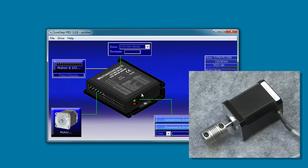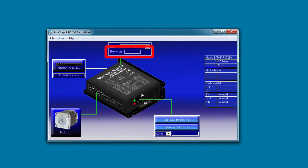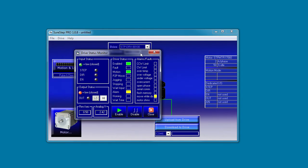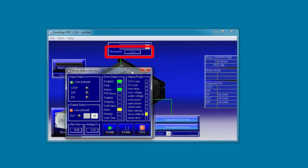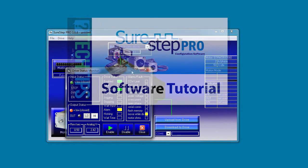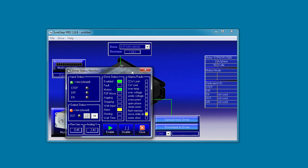To get the firmware rev of the drive, just issue any command that reads from the drive. You could do an upload from the drive, for example, but I usually bring up the status monitor so I can see what the drive is doing, and that automatically fills in the firmware rev. We'll cover the status monitor in detail in the next video, where we'll walk through all of the features of the SureStep Pro software so you can get the most out of your SureStep system. The firmware rev also updates automatically if you have the correct COM port selected when you power up the drive.